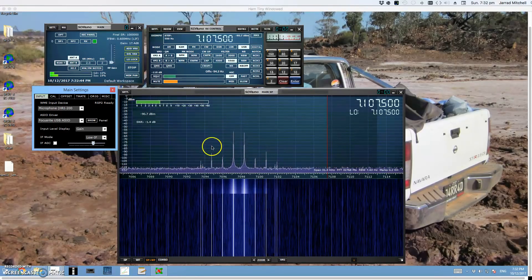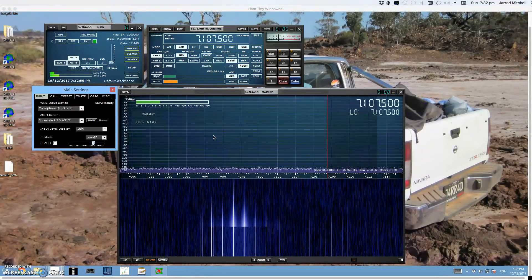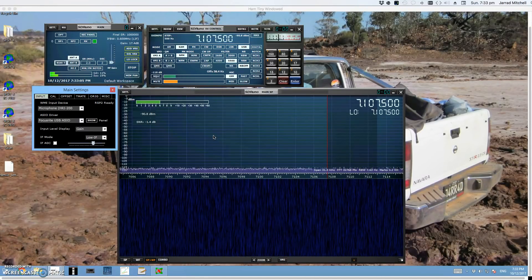Okay, IMD5 was about 35 dB down on the peak tone, so that's negative 41 in the ARRL method — and that was just by reducing the power from 100 to 75 watts. You can see that just by backing off a little bit, there are some gains to be had. Now I'm going to change the radio to 50%, and 50% on my radio does read 50 watts on my PEP reading meter. Let's do it again.